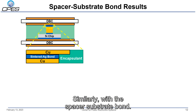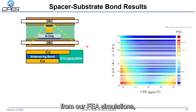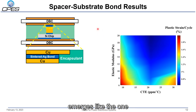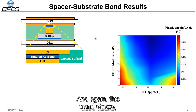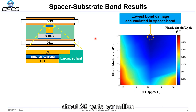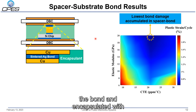Similarly, with the spacer substrate bond, if we look at the results from our FEA simulations, we can see that a similar trend emerges, like the one with our other spacer bond, in terms of the effects of the elastic modulus and the CTE of our different encapsulants on the plastic strain per cycle on the bond. And again, this trend shows that the encapsulants with the highest elastic modulus and a CTE property of about 20 parts per million per degree Celsius yield the lowest amount of accumulated plastic strain per cycle inside the bond,